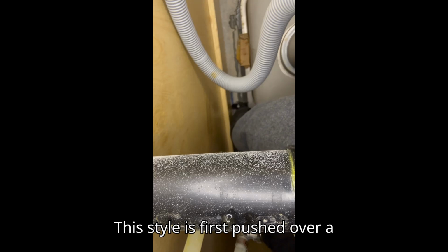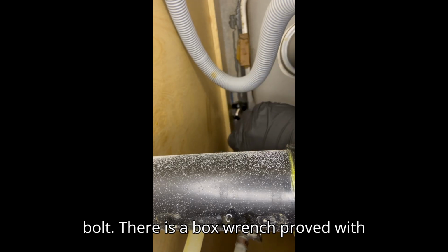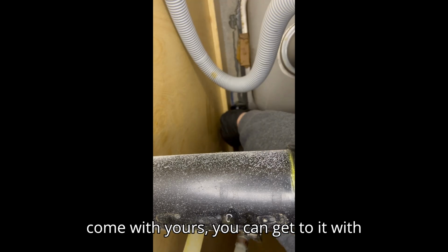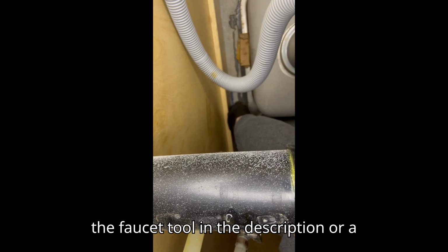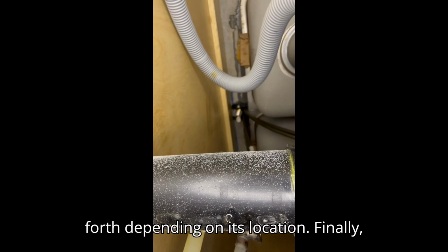This style is first pushed over a threaded pipe and then secured with a bolt. There is a box wrench provided with this and most faucets. If this did not come with yours, you can get to it with the faucet tool in the description or a crescent wrench, channel locks, and so forth depending on its location.